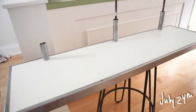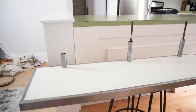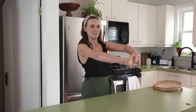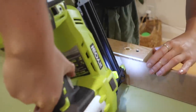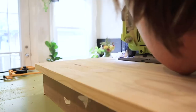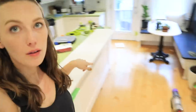The stainless steel countertop is gone — I'm so thankful, this is already so much better. This morning I cut some pieces of wood at the office. I'm honestly kind of making this up as I go, but I'm making a replacement top. I'm attaching two pieces of wood together and screwing those directly into the counter, then I cut some MDF strips to create a box around it and nail-gunned those to the inner pieces of wood. The last step is screwing a wood board to the top, and to save everyone from bumping into corners I rounded the edge with a jigsaw, sanded it down, and primed it all.